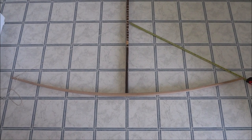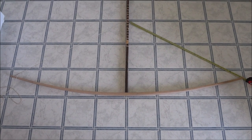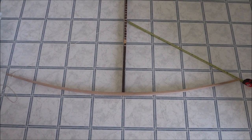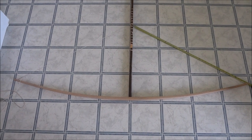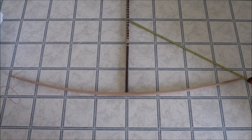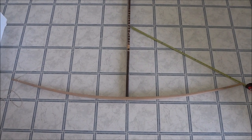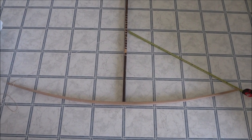What I do is put it on the scale and pull it down until it hits its draw weight with the tillering string — it doesn't put much strain on the bow. Pull it down until you hit your maximum weight and eyeball where it was at that maximum weight. You never pull over the maximum weight — never. It's set at 50 pounds. Once it learns to bend more, we put the real string on and keep going with this process. And if you ever think you're going to take a lot of wood off at a time, stick your head in an ice-cold bucket of water. Thanks for watching this segment.